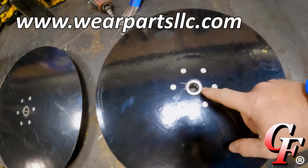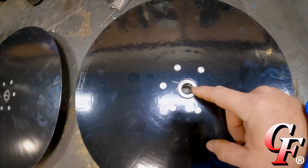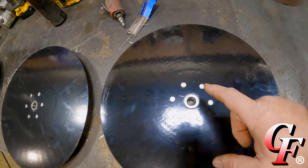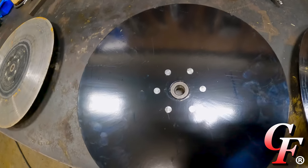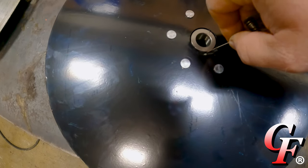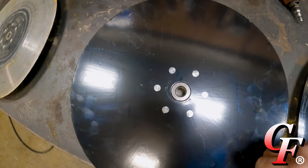For one thing they're a lot more precise in placing the bearing. You can see this bearing has a little bit of a gap around it — the holes for the rivets are going to have some wobble, and when they're manufactured at the factory this bearing might not be completely perfectly centered, which will allow this disc to wobble a little bit as it rotates and can affect seed placement and accurate seed depth. On our factory one I've got my torch tip right here and we're going to try to stick it in the gap — it goes in real easy, no problem. But on the other side it will not go in the crack, so this bearing does not perfectly center this hole and can allow the disc to wobble.